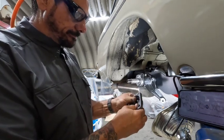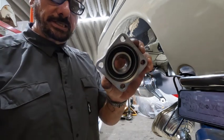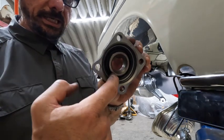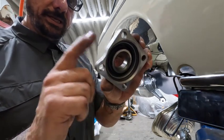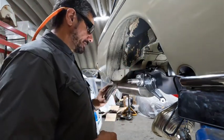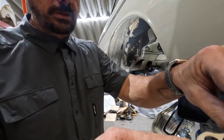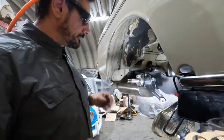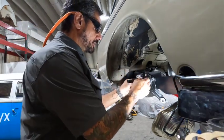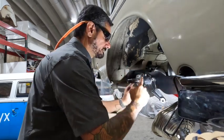The reason I do that is I want to make sure that spring we showed earlier in the seal install stays in there. Sometimes you can put this thing through and not realize the spring has come off inside. If I do this and put it in my cap when I put it together, I know it's in the proper location. Our outer o-ring goes right along that edge there, basically caps over the bearing. Once again, try not to roll this - don't put a twist in it.